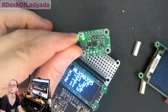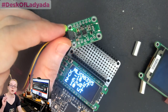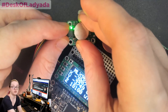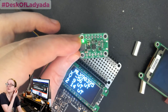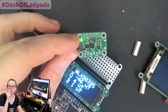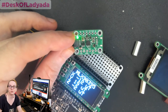In the comments when we posted the coming soon, they wanted to know when does it stabilize — those numbers that are jumping around. The lowest bits are just a little noisy; you can oversample and you can filter. It's really meant for measuring 10 to 20,000 microtesla, so if you have 0.1% noise that's going to show up like this. Normally we have very high accuracy and high precision, but a low range magnetometer. This is a 16-bit magnetometer, and at the bottom a couple bits are always going to be a little noisy.